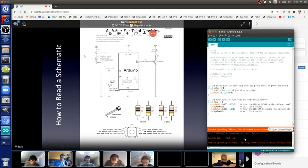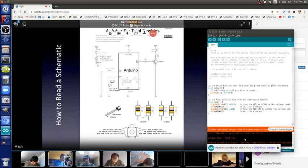And then I also put the schematic, which you usually don't have in a schematic for a project. I showed the schematic for the power supply battery pack. So there's a red wire and there's a black wire: power, ground. This is the symbol for batteries, alternating long and short lines. And the longest line on top is plus. And then here's a switch built in.